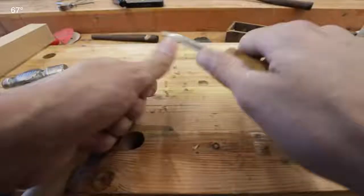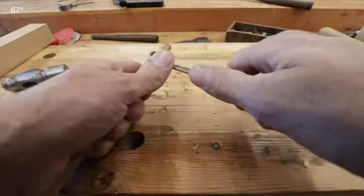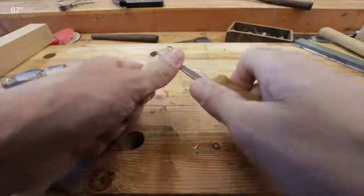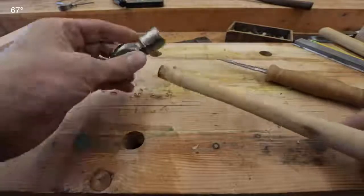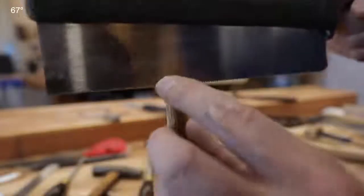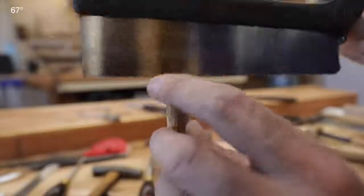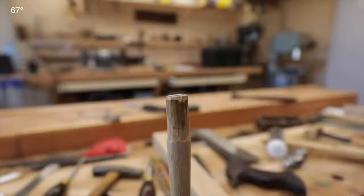That was something they taught children because they didn't know any better — it doesn't apply to us today. You can put a plane down on a wooden bench with the blade down; that's not going to hurt a thing. You can cut towards yourself if you have experience and know what you're doing. Anyway, that's my pet peeve. Let's trim that up and check orientation. When you know you're getting close, pull it out and get ready to cut your kerf. I'll use a saw with a very fine set of teeth — actually my Japanese back saw, which is even finer.